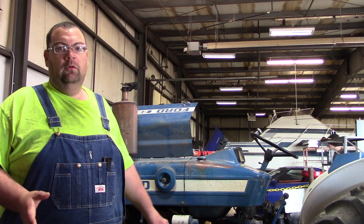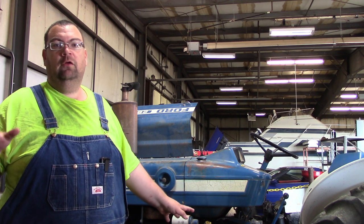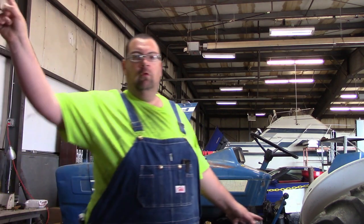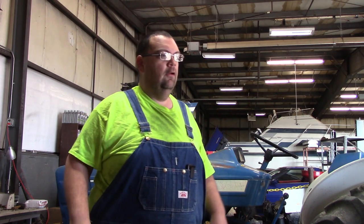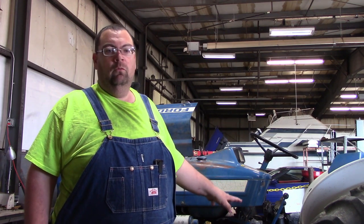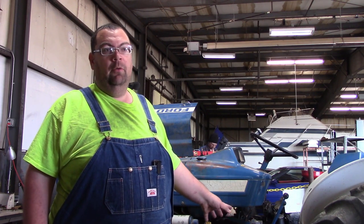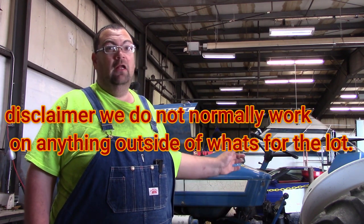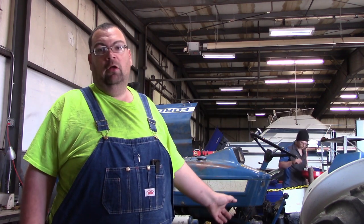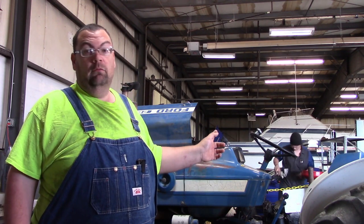So guys, to give you a little bit of back history here, Crazy D and I did a video over on his channel, Crazy D Equipment. I'll try to link it in a card up over here somewhere. Anyways, we did a video trying to figure out why this thing wasn't starting. We found that it was a neutral safety switch, and that's what we're going to put in this morning. We ordered new wires and they just never showed up, and the guy's really wanting to get the tractor back, so we're going to try to use the old wires and get the neutral safety switch put in. Let's get to that.